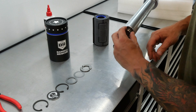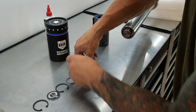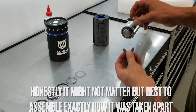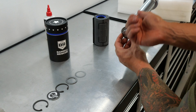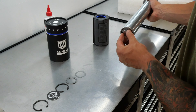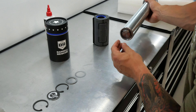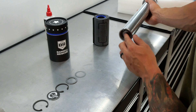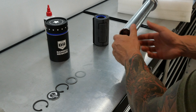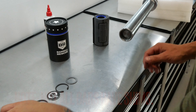Now we're ready to reassemble. Take your sleeve, slide it over, and you might have to hold it and twist as you go. We're going to have to push it past a little bit, just up to the knurling, because we need to move it back a little so we can reassemble our parts in there. The first thing again was the washer — go ahead and put the washer in there. You might have to use your snap ring pliers to push it in a little bit more. Now you're going to take your split collars — there's a round side and a flat side. The flat side is going to go facing inboard. Remember that.